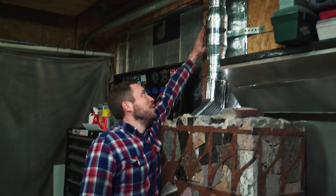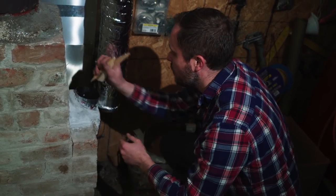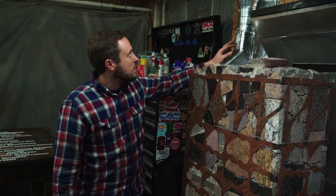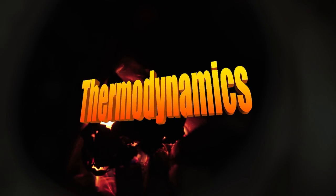I've been putting off making this chimney and damper system for just under a year. Time to fire this thing up. Got to make sure it's open before I start a fire in it. I don't have a whole lot of wood left, but I saved what I have. I always throw a little kindling — small shards from splitting wood — in here. Then I plug in the fan; I should probably just put an on-off switch. It only takes a couple seconds to get this thing fired up and have that rocket noise going. Even with a screaming fire going down there, the exterior is room temperature. It'll take about an hour before this actually starts to get even a little warm to the touch. And even right now, without the fan running, the flow is going the right direction — it's just not making that rocket noise because the system isn't warmed up yet. The heat coming off that helium tank is intense. I started to feel like my shirt was on fire.